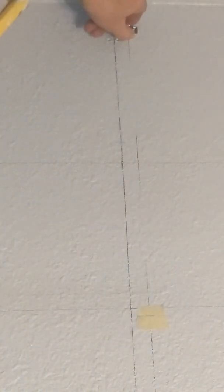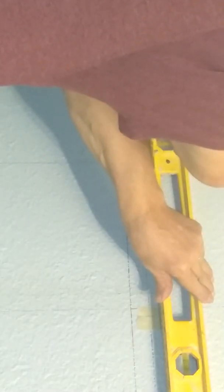All right? I have this bracket anchored. It's solid. Set this down on that bracket and bring this down to level. Then you know you're going to be right on top and at the same location as the bracket or the mount on the other side. Now, the top of your mount or bracket is going to go to this pencil line. Okay, right there. We're good.